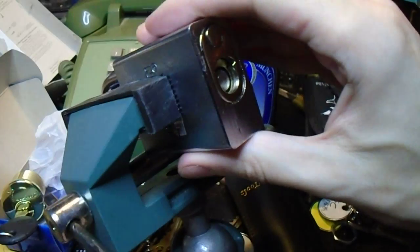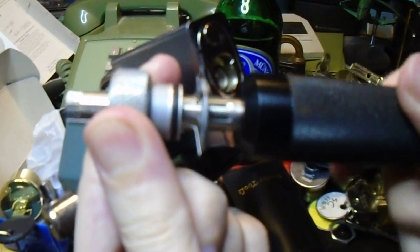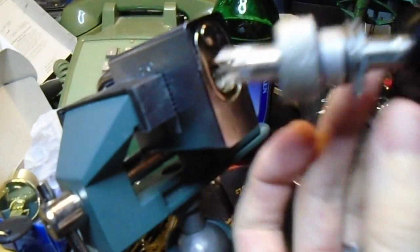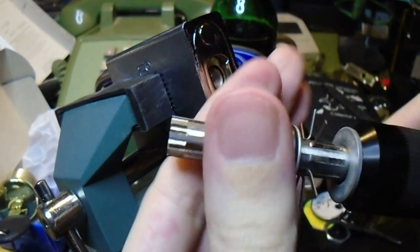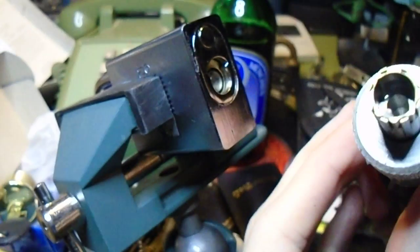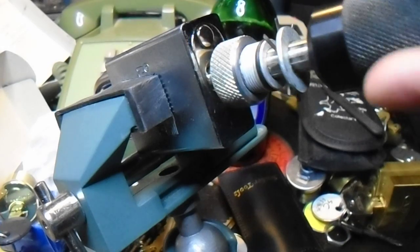But let's see if we can get this open for you on camera. As before, we're going to take our convertible tubular lock pick, lighten the tension, zero the feelers, and tighten it up. Compared to others you might encounter, we've got to go very tight on the tension with this because it does have some very strong return springs that will over-set your feelers very quickly.